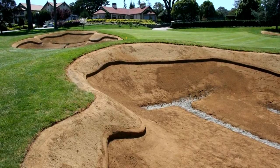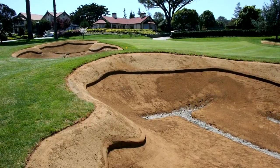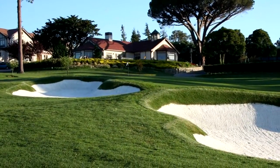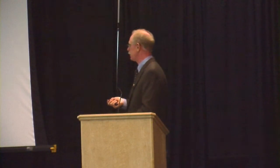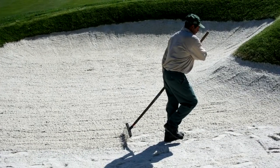Plus a maintenance saver is getting those trenches cut across, up on the face. Sometimes even getting guys to dig them by hand way up on the face may be necessary. But then after that, the sand with a rake handle slope, that angle of repose slope, and everything's hunky-dory. And these bunkers look really the same 2 years, 3 years later.